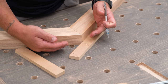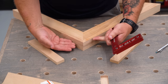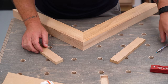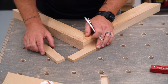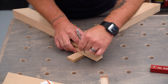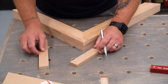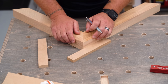and that is the angle that we need. Cut both of those pieces to that same angle and it'll fit together just fine. Now I've switched it up to an acute angle — we're going to go on the outside, and it might look 90 degrees. But if we put a square up there, you can tell this is definitely out of square, but it works the exact same way. I slide one up on this side of the wall, one up on this side of the wall, I hold them together, we make a simple mark here and here, and all I have to do is connect those two dots. That is going to be the angle we need — cut both pieces to that angle and they'll slide up and meet in the middle.